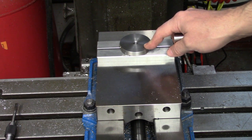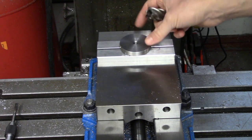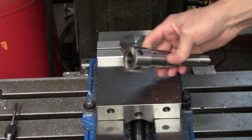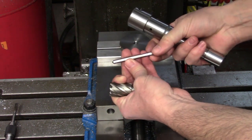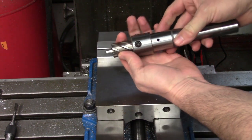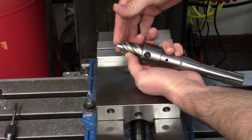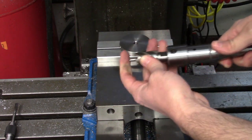The RPM needs to be slow and that means it is easy to take too big of a bite at one time, so you are either going painfully slowly or watching all your hard work shift in the vise — neither is my idea of a good time. This annular cutter will go through the part relatively smoothly and leave a nice surface finish on the side. I have a special annular cutter holder with an R8 shank. There is usually a pin that goes through the annular cutter and there is a spring down in the holder with a plunger. When you put this whole thing together, the pin will get pushed in as you cut — there is actually quite a bit of tension behind it. If you were cutting a full hole, the pin would eject the center slug of metal from the cutter when you're done. I shouldn't actually need the pin though because I am just cutting a partial circle, so I will leave it out.